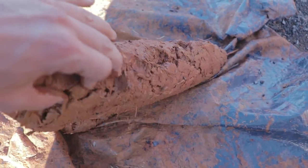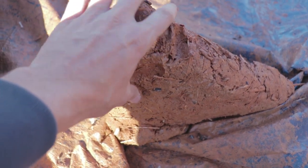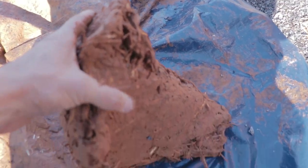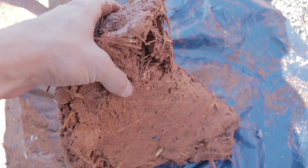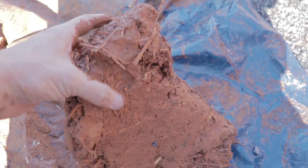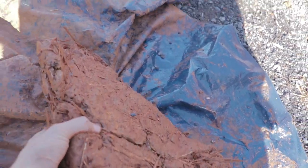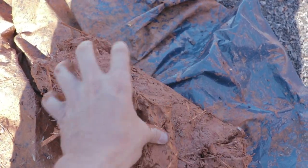Here's the first cob mixture. It came out really dense, which is good. What I'm hoping with the crusher run gravel is that it prevents cracking in cob — that's a very common issue, as cob tends to have long vertical cracks as you build high walls. There are a lot of factors that go into that, but I think the aggregate has a lot to do with it. So I'm hoping this crusher run gravel solves a lot of those issues. This thing is dense. I'm going to start packing it into the form and make the block.